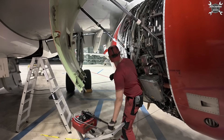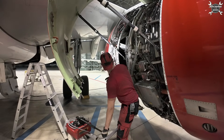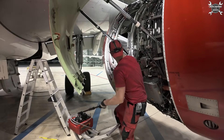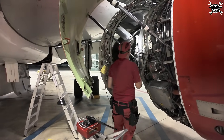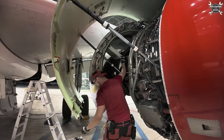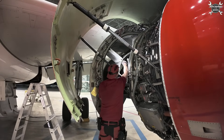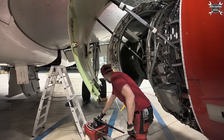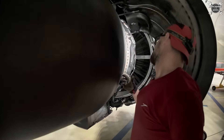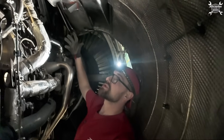It's going up. We have again a safety feature on which the C-duct will rest, and we have two positions for this. I'll show you the first one in closer detail. Okay, so I approached the first position — all we need to do is disconnect this lever and place it under, and release the pressure. Then we install the pin and that's it — now it's safe. You can even release the pressure and all the weight of the C-duct will rest on this arm. The workspace in this position is very tight, but you can still access most of the components.